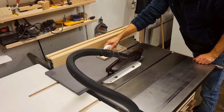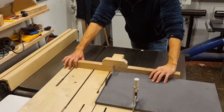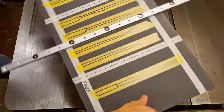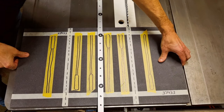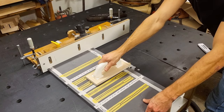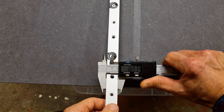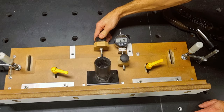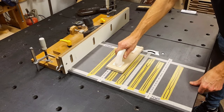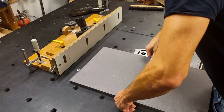I start by cutting my material to size, then I make a rough placement of the runner, the saw blade tracks, as well as the dovetail tracks for the clamps. Then I route the shallow pass for the miter runner. I use a 15-millimeter router bit and make the first pass, measure how much I'm off, then adjust my fence accordingly and make a second pass. This gives me a really good press fit.